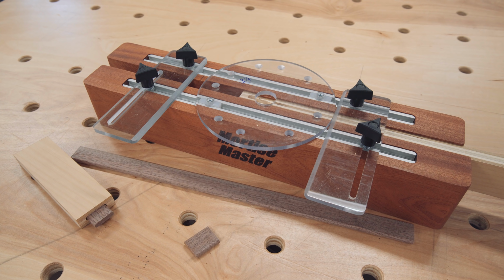So I can slide it out, relocate my material, and I have access to the bottom of the jig over here, so I can use that to assist locating the piece, and then clamp it in place, grab my router, make my cut, set it down. Anyway, this is a very fast and convenient setup once you have the jig set one time for the particular size mortise that you are cutting. Overall it's fast, it doesn't take much time to set this as well.